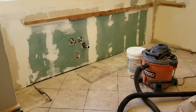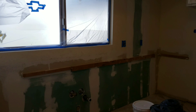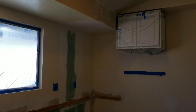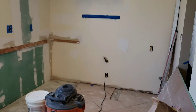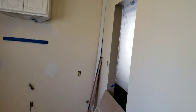We have put the green board on the wall. Those scrap pieces of 2x4 you see on there are going to be a ledge for the countertop at 36 inches — that was there previously and I left it. All the holes are now filled up, we sanded it down multiple times, put plenty of different layers on there, and now it's perfectly smooth, just the way it's supposed to be. We're gonna start mixing up mud.